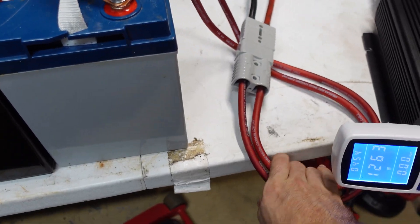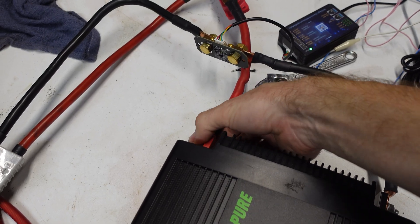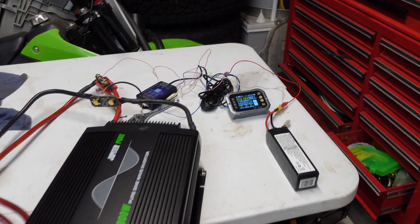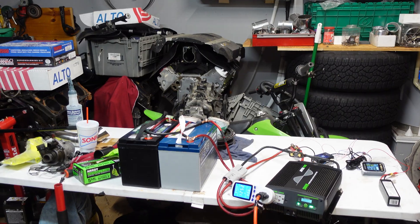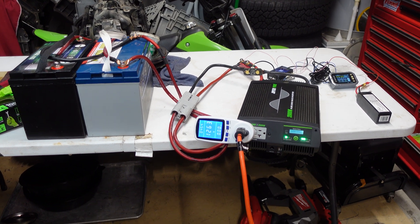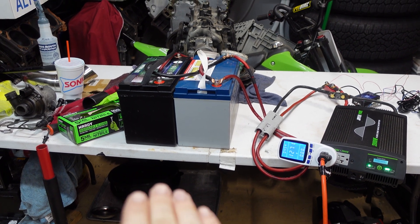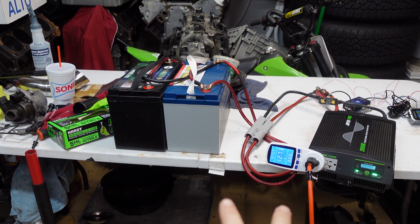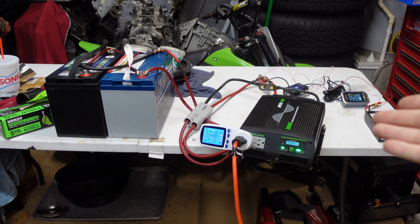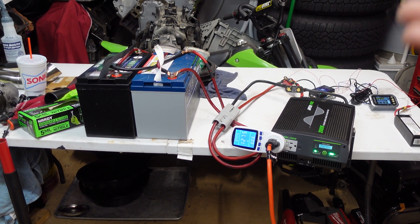Nothing feels hot, just a little warm. The inverter is fairly warm and the cables are a little warm, but nothing that alarms me. It's rated for 2000 watts and we're pulling 116 amps — pretty good. I'm going to let it run and make sure nothing gets hot or catches fire. It seems to be running the mini split just fine, which is awesome. Keep in mind, if you only have two batteries — about 2400 watt hours — at this power level it'll last maybe an hour and a half if you're lucky.